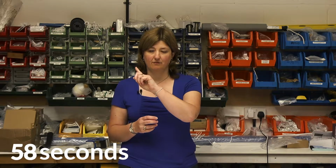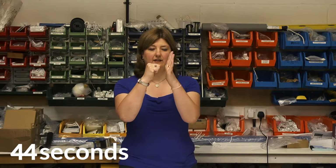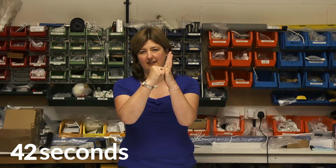You can also have a wave or a ripple heading. This is a really contemporary look. The track does need to come a little bit further away from the window so that the curtain can go backwards and forwards from the track in a continuous smooth wave. And all of these headings on a motorised curtain track need to be hanging underneath the track. You can't have the track and then the curtain standing up above it.